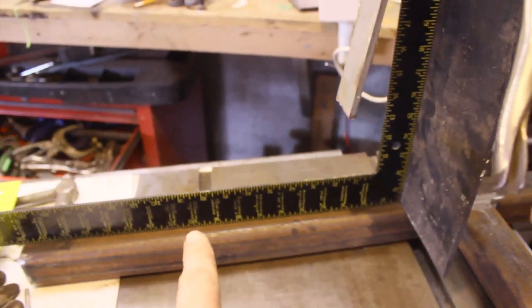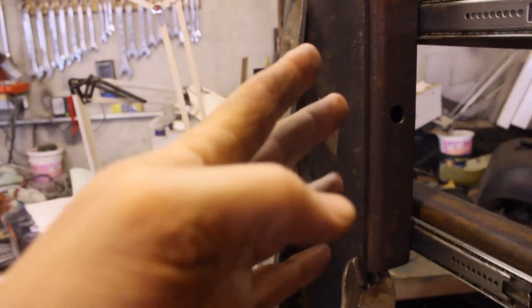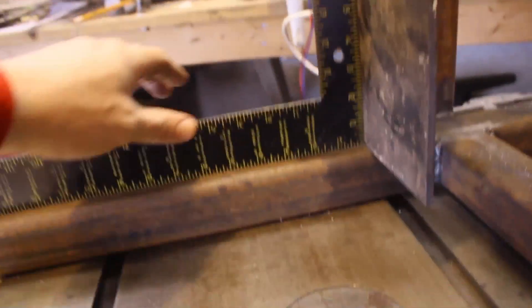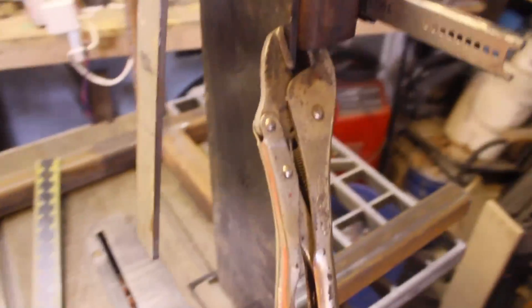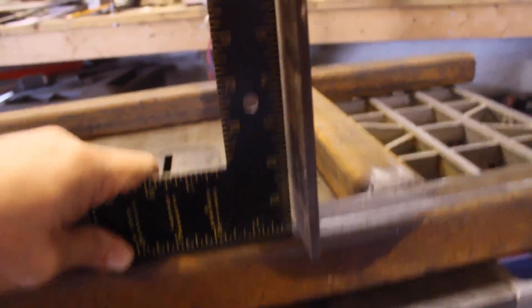Taking a peek at square first, trying to make sure that my table is going to be square to my gantry. I took a piece of plate — because that's the flattest, longest thing I've got — and clamped it to the moving part of my gantry, put the old square on it, and this side is just dead nuts, all the way up flat against the thing. When I move it down to this end and square off of a good straight mark here, there's a gap, and then it's tight there.